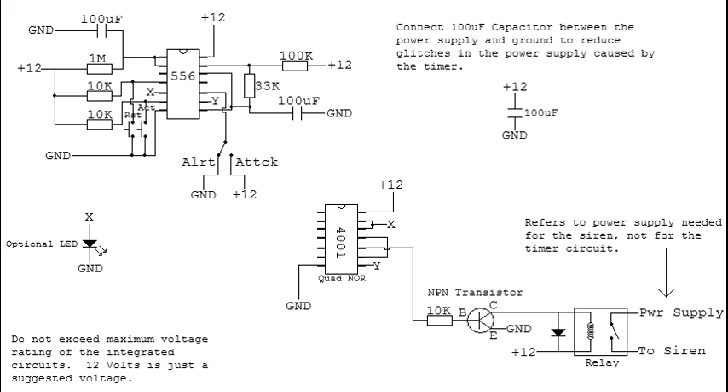You want to make sure the transistor can handle the power required to keep the relay on. You definitely do not want to hook the relay directly to the CMOS output on the NOR gate, because you'll damage something. Additionally, the protection diode in parallel with the coil — you need that on the relay. Otherwise, the voltage created when you turn the coil off could possibly damage the transistor, so just keep the diode there. It doesn't have to be a high current diode; a small signal diode will work just fine for that.